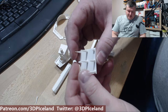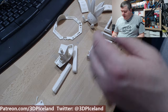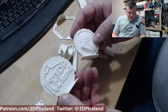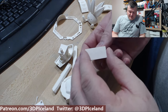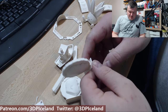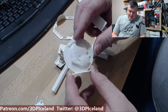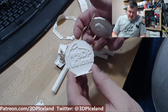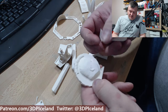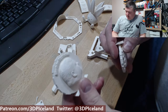I was really happy with that print, and then I printed out my MakerCoin — two of those. They came out pretty nice as well. I was printing this on my Prusa MK3 and it was coming out excellent. The MakerCoin has pretty good detail in the lettering and on the back. They're printed without any infill, standing upright on the printer, and giving great results.